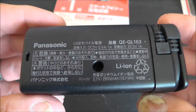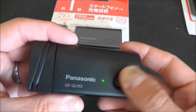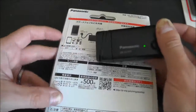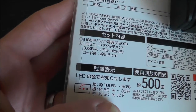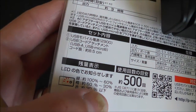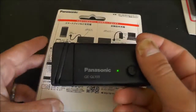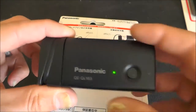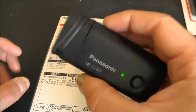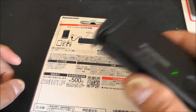Obviously, being Japanese only, there's no CE marking on these. The light is green — you can actually see it here. It's going to be green from 60% to 100%. It goes amber when it's between 60 and 30%, and red when it's at 30% or below. Once it gets to a certain point it does switch off automatically. They also switch off on their own when there's no load on it — so if it's been accidentally turned on they will switch off, which is another nice feature.